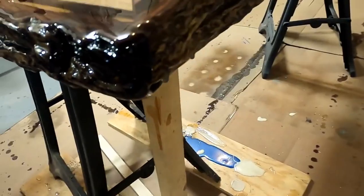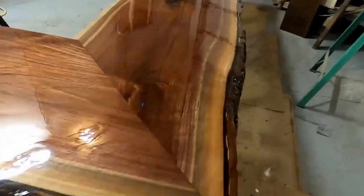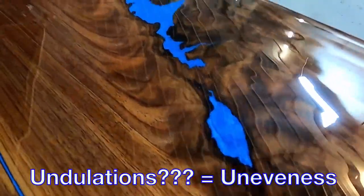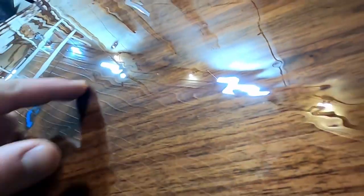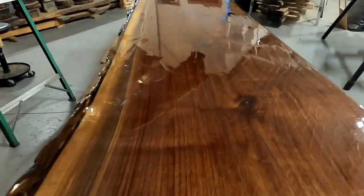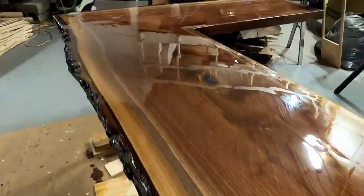The second seal coat has dried at this point, and you can tell that it looks a lot better than the first seal coat. Some people might even be happy with this at their own home bar, but this being for a client, I'm going for a glass-type finish with no sorts of undulations when you look down the epoxy. I'm pointing out just a couple of spots that won't really fill in with the epoxy — what I'm probably going to have to do to those spots is use a burn-in stick. With the seal coats you're going to eliminate 98% of those. A burn-in stick is just a hard wax that you melt into the spot and it fills that little void, then you can put epoxy right over. It's color-matched to walnut, so you can't even tell it's there.